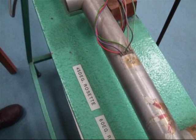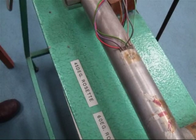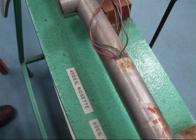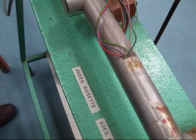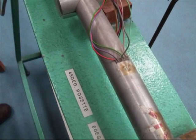We have some electrical resistance strain gauges. We have a shear pair at 45 degrees, which measures the shear strain. Combined with the Wheatstone Bridge, they will give the shear strain. We have also got a longitudinal gauge, which measures the bending strain.